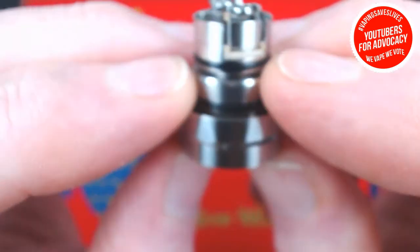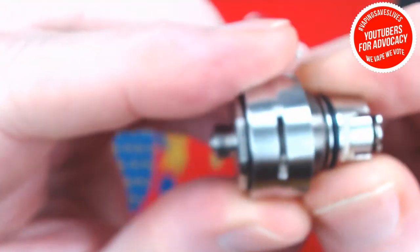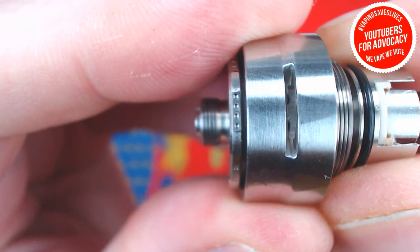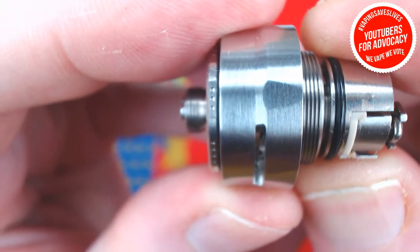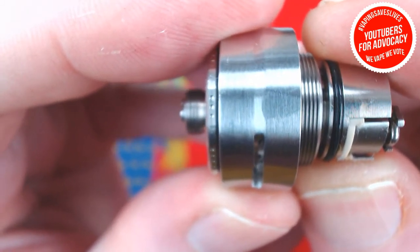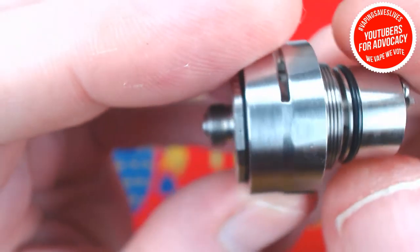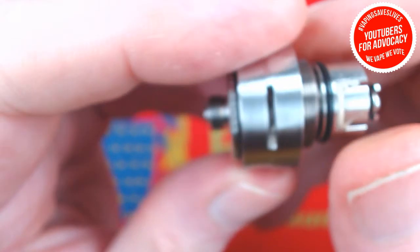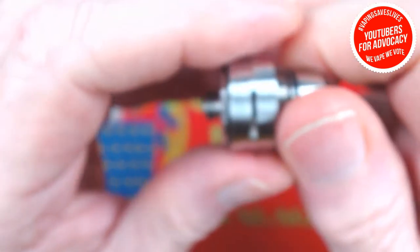Okay. You have four separate airflow adjustments on here. You see those little pips there? That's fully wide open airflow. Next one down is three pips. That is the next restrictive airflow, two, and then one, which is, well, golf ball through a garden hose type. Okay? In order to make the adjustments, what you do is, as you saw me do, you push up on this, you turn this until your airflow adjustment is right over that, and then you pull down on it.